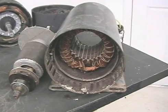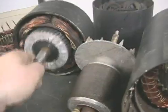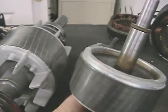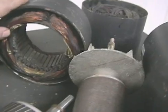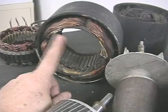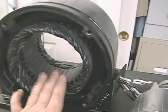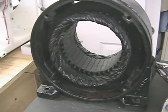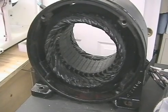One of the next steps is I'll be using this motor — which has a really close number and everything to the other motor — but it has aluminum caps, so it's a good induction motor, only at high speed because it's set up in a quad field configuration. I'm going to rip that out and rewire it similar to the best-performing motor, then put it back together to really determine why this winding configuration is so much better. It is part of a larger motor that will be driven by a pulse motor.